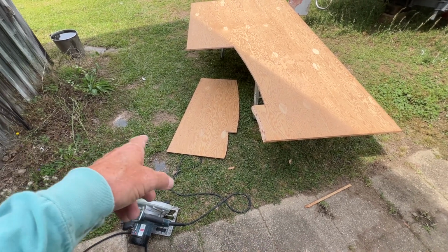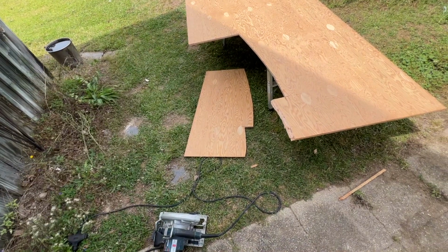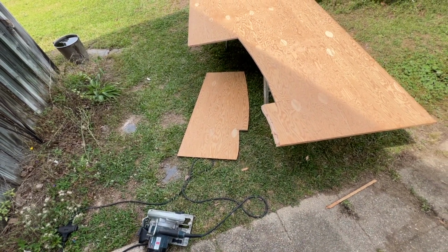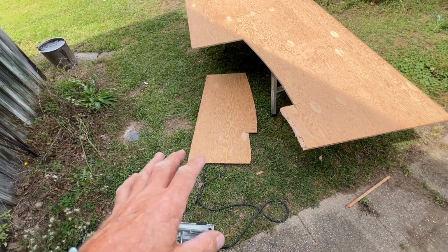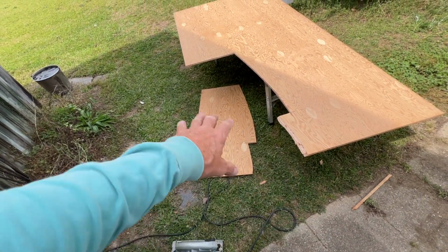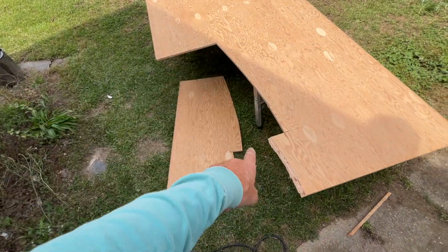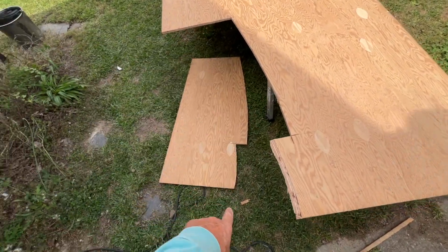Now that said, I will seal every single edge and also the bottom surface of it. I will seal with epoxy resin. And then once I've installed it in the thickened epoxy and all that, I will coat the whole top of it with epoxy resin as well, and then tab it back in, down that length there all the way through.